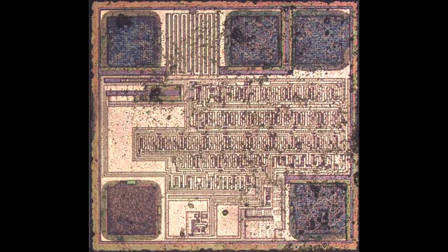Let's take the circuit board away from the integrated circuit, take off that epoxy, and take a look at the controller to see how they achieved this blinking function. This is the silicon die inside of that blinky ball. It's quite small — one millimeter on a side. In fact it's so small this is my only photograph of it, because after I took this photograph I managed to lose it somewhere in my workshop.